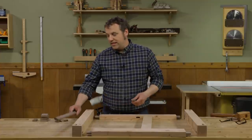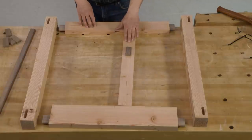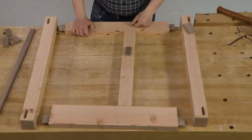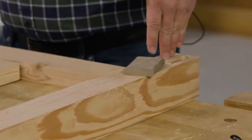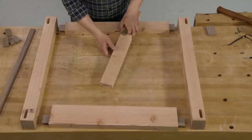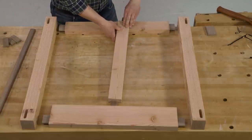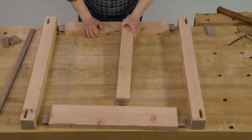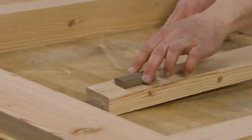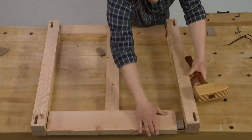On this project I ended up with two different sizes of loose tenon — the smaller ones for joining the center stile with the two rails, and the much larger ones for connecting the rails to the legs. One thing to mention when cutting loose tenons to length: you want the length of the tenon to be slightly less than the combined depth of the two mortises. That way the tenon isn't going to bottom out and the pieces are going to close nice and tight.